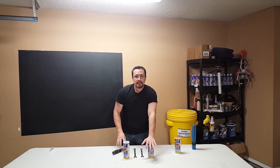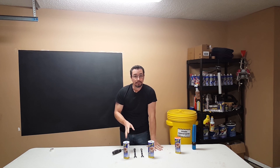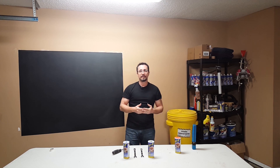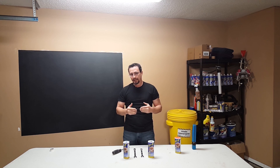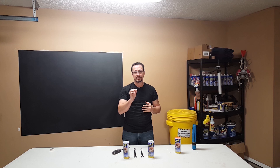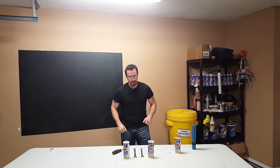We're going to do things a little differently today. I'm going to take one of these cans and shake it really good, and take the other can and stir it really good. From personal experience, you're going to get air bubbles in the finish either way — it's kind of hard not to. But if you take your time and keep an eye on those air bubbles as they pop, give it a twist up-and-down motion, those air bubbles will self-level and work themselves out. So let's go ahead and get started.